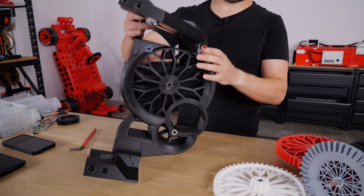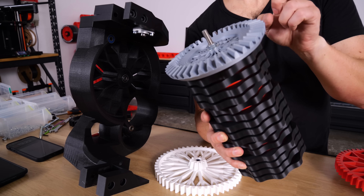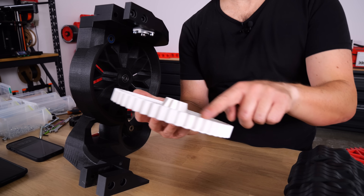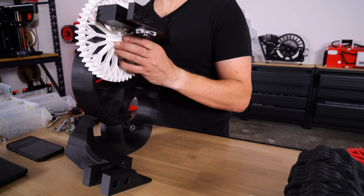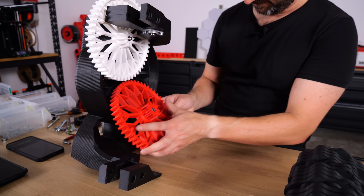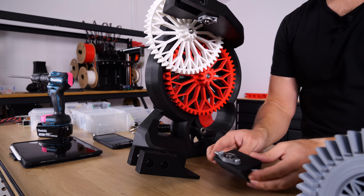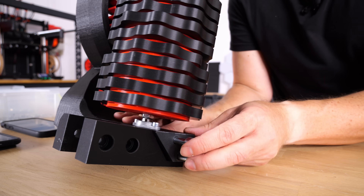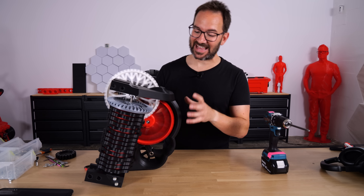I've made this bracket to hold the stack. The stack has a 40-tooth gear. This output bevel gear has 10 teeth and this one has 40, so this is a 4-to-1 reduction. And this one is just another 4-to-1 reduction gear. Using this bracket, I can now get the stack in place. And that's it — a spinning cam disc stack.